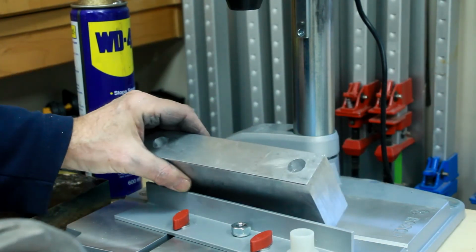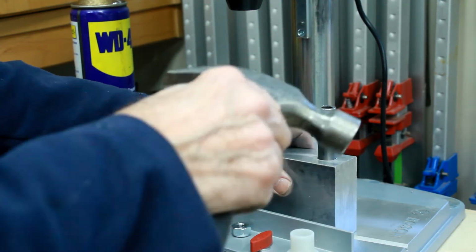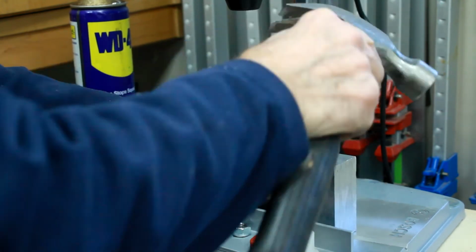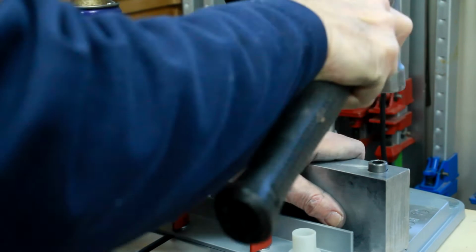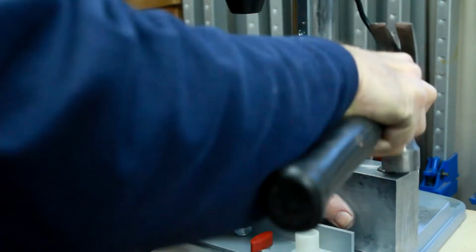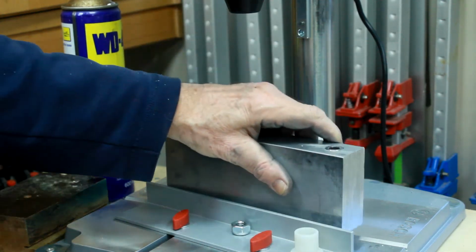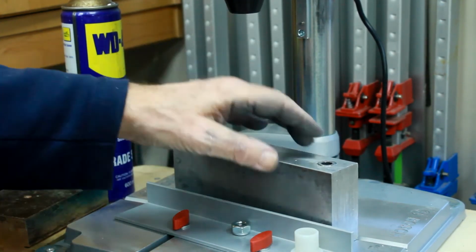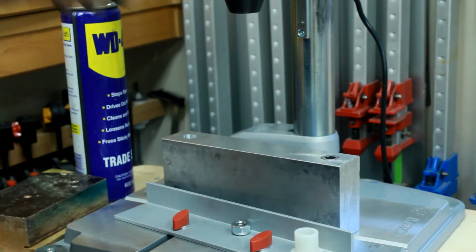Right, so that's got the holes drilled for the kingpins in that billet, and they're both now reasonably able to put the inserts in nice and tight. I'll then drill through, I think, and put another grease nipple on so that that'll actually grease the pin itself. Let me just get the pin.